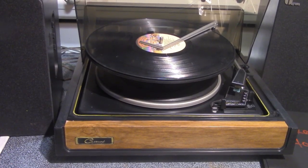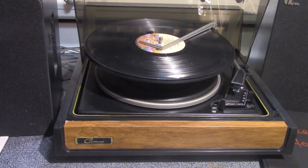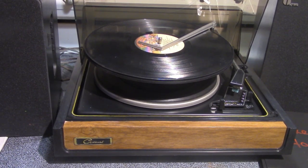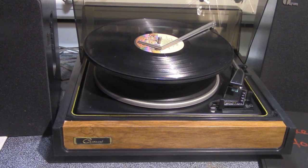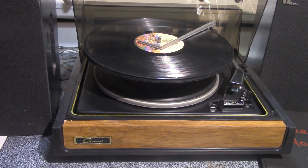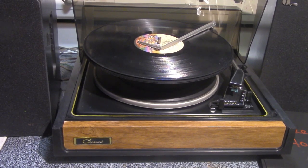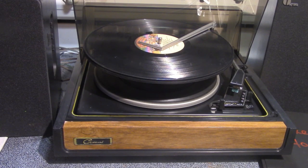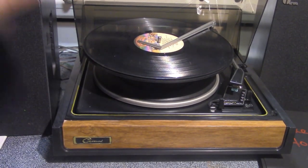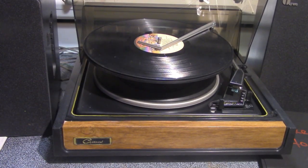You can get the best sound out of your vinyl with the magnetic cartridge. I do like ceramic cartridges in certain instances, especially in combo players, because manufacturers build their amps to whatever player they attach to a combo unit — that's why ceramics can sound so good in those. But there are also higher-end combo players that have magnetic cartridges, and in that instance the manufacturer puts a preamp inside so you can experience the clarity of using a magnetic cartridge.